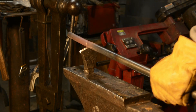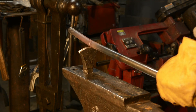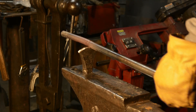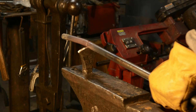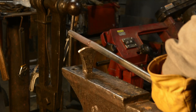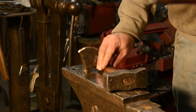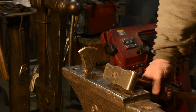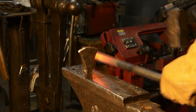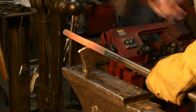I'm going to take two heats to cut this piece off. Just work evenly cutting from all sides defining that cut. I'm going to take another heat and cut it off. We will not be cutting this completely off on the hot cut. We're going to leave a small amount of material on the bar and we're going to break it over the edge of the anvil.